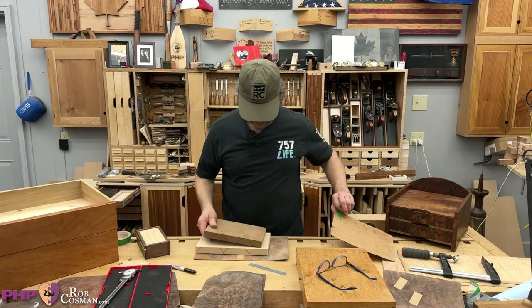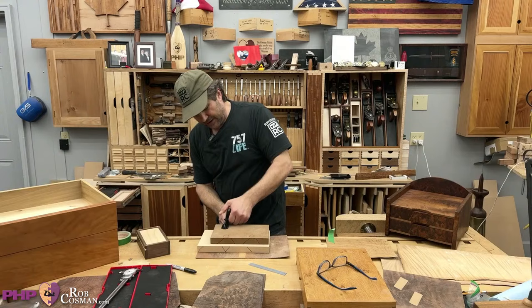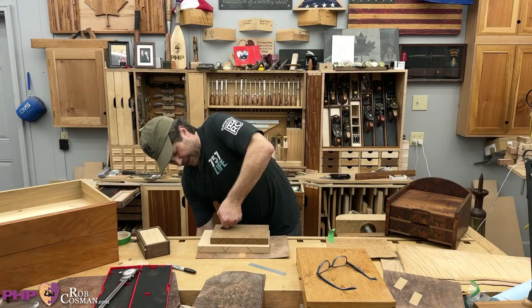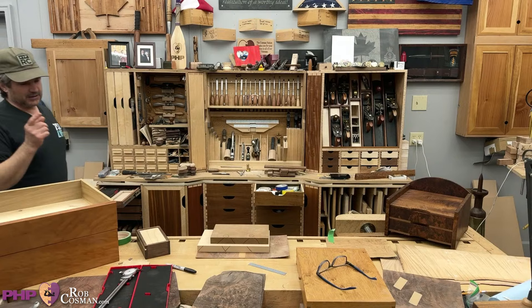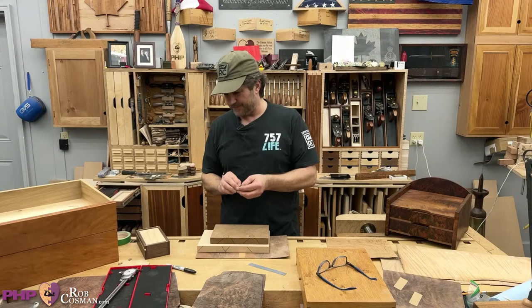When you apply your clamps, always make sure you push down on the surface before tightening, because if the clamp is on an angle it's going to want to skirt and shift something. Put the clamp on, hold the flat surface tight, bring that up, and snug it from down there — that minimizes any shifting. So: tape the edges, use the right glue, and when putting clamps on, line everything up and keep the flat spot flat before tightening.